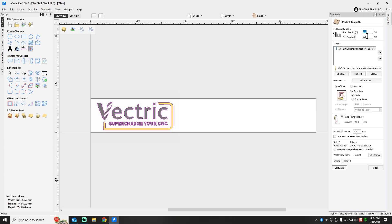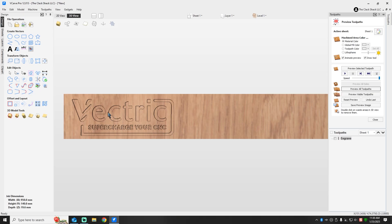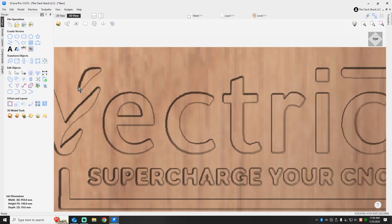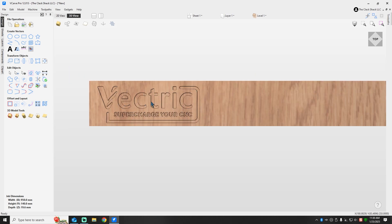So I'm going to hit the apply button and that should give us the image as we need it for our tooling. Now these shapes are different colors and they're going to be painted different colors, but there's not going to be a whole lot of difference in the tool path I'm going to use for these. So I'm just going to select all of those together and come over here and set up a pocket tool path. I'm probably going to go ahead and go with two millimeters depth — that way, especially with me backfilling this, if I do get a little bleed-over, having that two-millimeter depth is going to give me a little more room for sanding to sand some of that off in the event that I mess up. So we're going to name this layer 'engrave', calculate it out, and preview this tool path. You can see what I'm talking about with the edges — see how it's rounding these edges, because the tightest corner we can make on the inside is the diameter of the bit. I'm running an eighth-inch bit on this job.